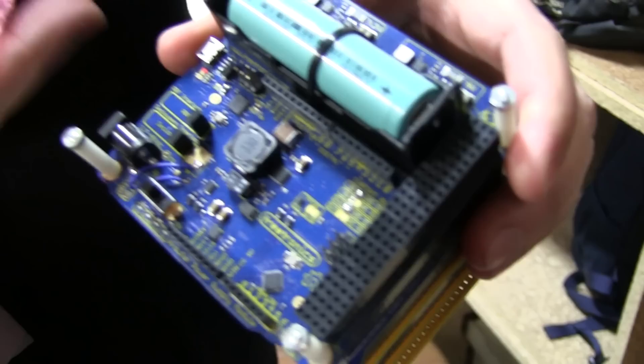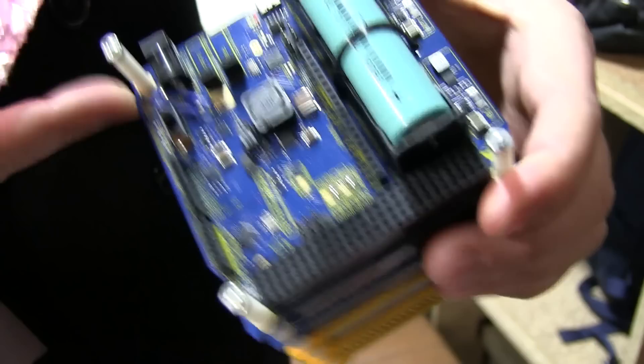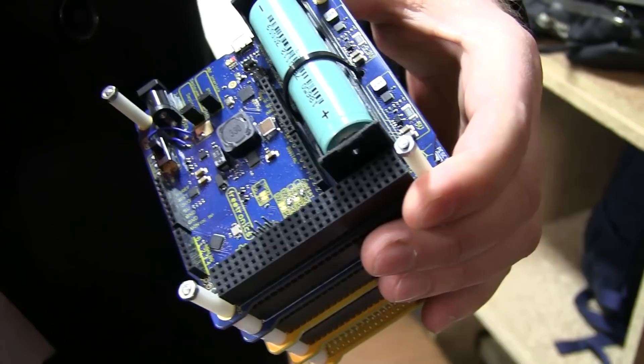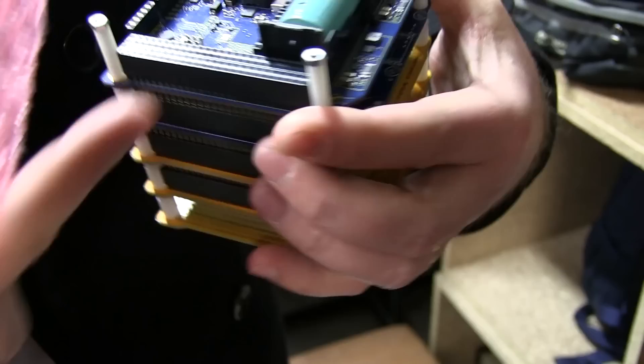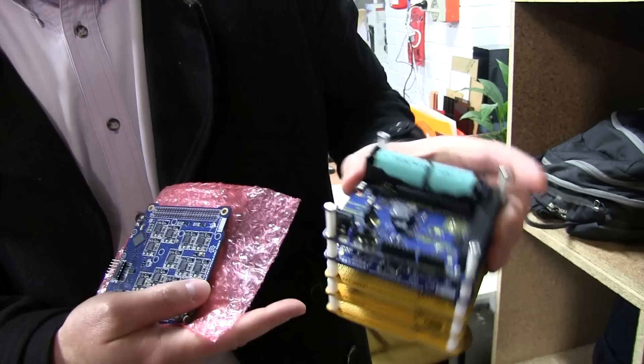This on the top is a prototype of a satellite power supply module. It's got input from solar cells so it can charge. It's got a management processor so that it can do things like measure current consumption and battery state. It's got a couple of high current switch mode power supplies on here which supply power to the rest of the satellite through the bus. The satellite has a stacking bus — basically the idea is that it's like a stack of pancakes. The satellite itself is just a series of modules that you build up and they all sit on the same stacking bus.